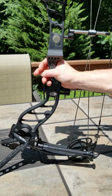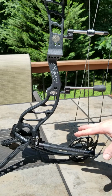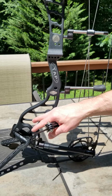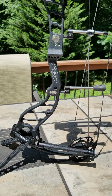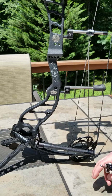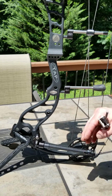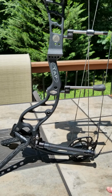All right, so there you have a setup, basic, with side stabilizer and our mount. And you can see the process for going from the installation of the screw into the riser all the way to the point where you're attaching a stabilizer to it. These mounts, when properly set up, when properly secured in place, are capable of holding substantial amounts of weight. But the key is that they are properly set up and they are properly secured on their juncture points so that you don't get rotation.